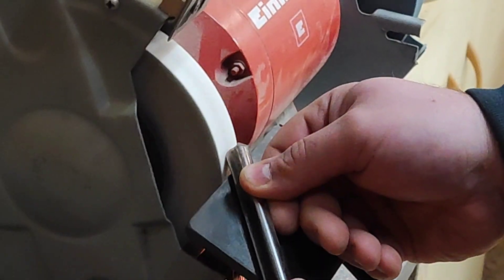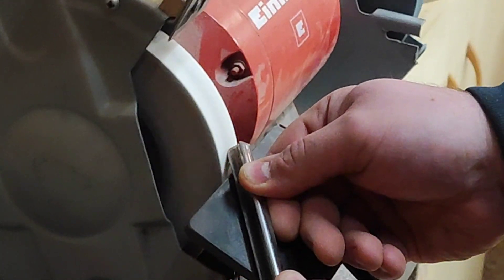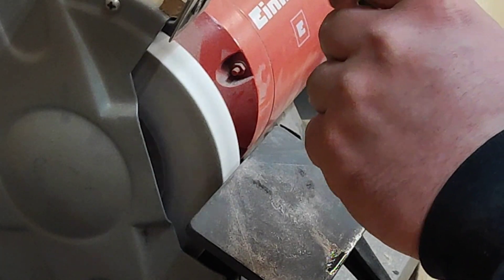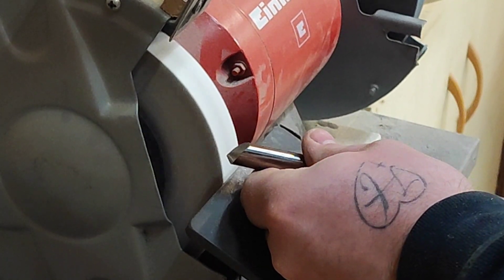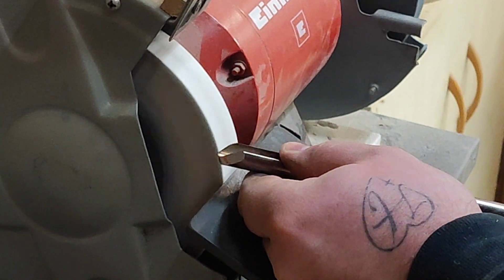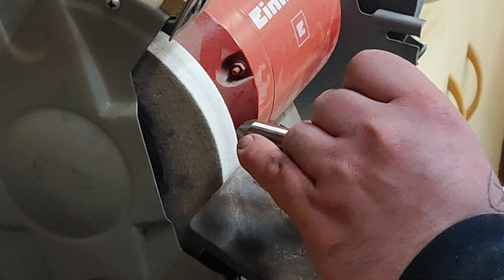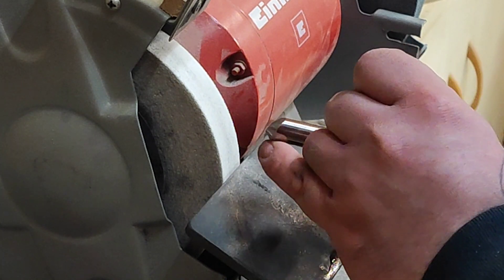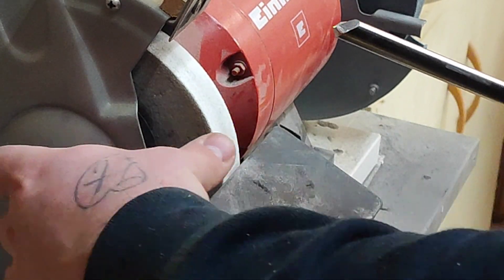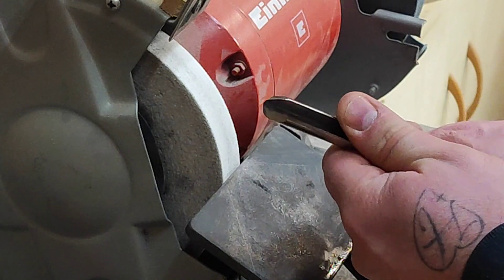With the CBN you have to have a light touch and press hard on the tool rest. This is much more usable and versatile shape of the gouge — you can do a lot more with it. The bevel is around 6mm or a quarter of an inch and I'm going to reduce it all the way around. I just do it by hand since this is getting a bit smaller. The wheel is around six and a half inches so I want to reduce the bevel.